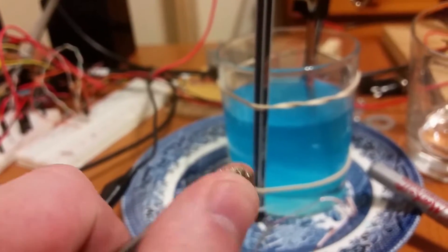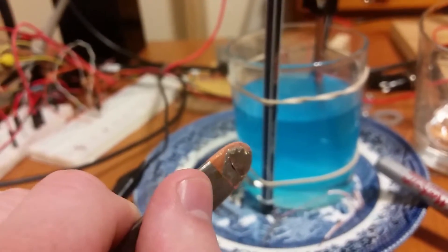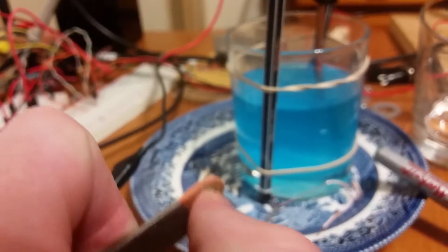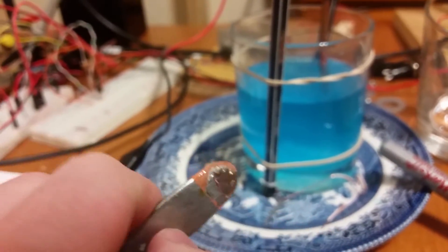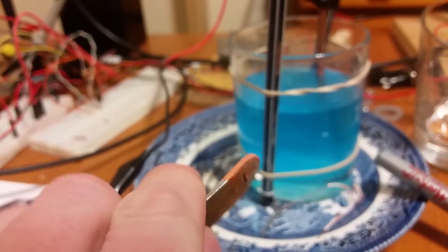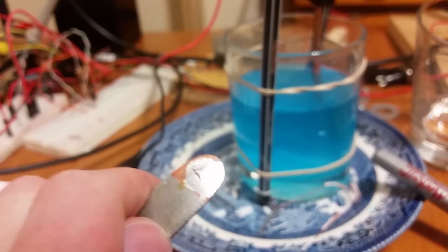You can see here that I've used a pair of pliers to scrape it off. So it does come off, but the bond is pretty damn strong — I have to scrape it good and proper to get it to start coming off. So I think that'll work for all intents and purposes. If you ever need to solder onto a metal object, copper plate it first.